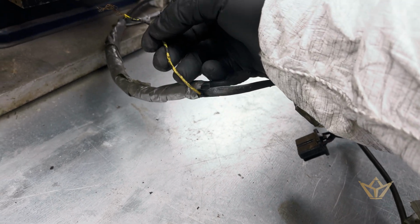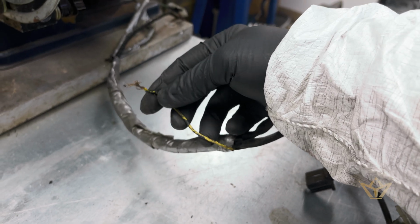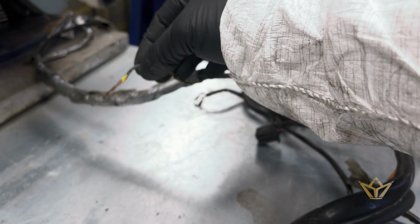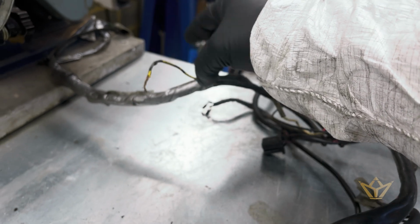But then again, this is the original color and it will lead us to the right place, and if it's still the same length, then fine, just reuse it again. So tin it and then make sure that you have the right fitting that's soldered on the end of that, and you're good to go.